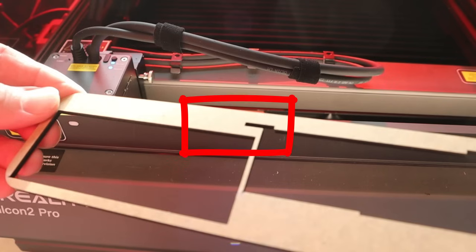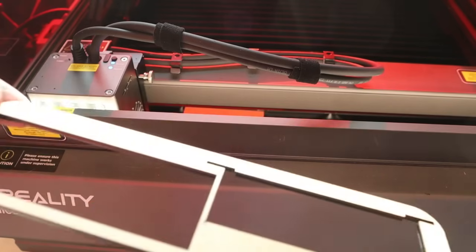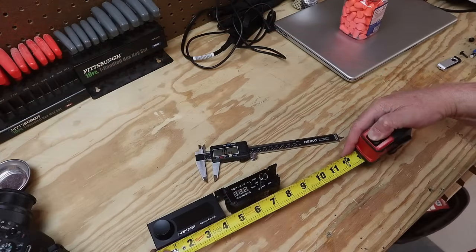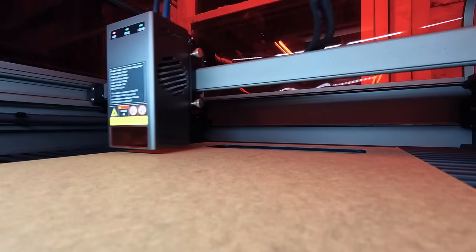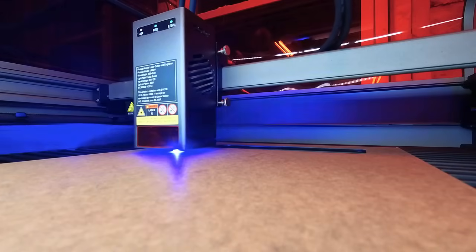This little wing right here is 1.5 millimeters, which is 0.05 inches — for really small details like that, a laser is the way to go. But that's not going to work; there's not enough clearance inside the pocket for both of these little boxes to fit. So it's on to Plan B. It turns out the DSP can be configured as both a volume knob and a bass knob, so I'm going to make a mount for just the DSP controller.